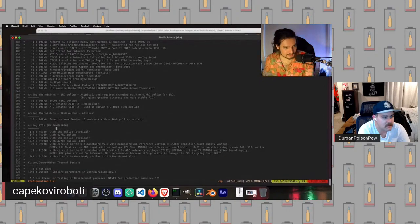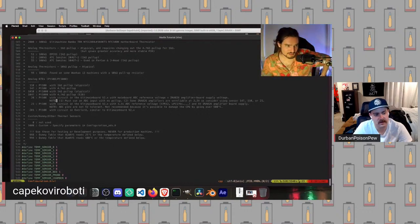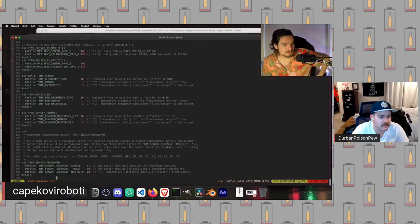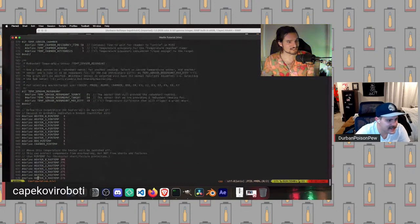Another one to remember, because I think a lot more people are using them nowadays, are these ones down here. These are for the RTDs instead of traditional thermistors, like the PT100 and PT1000. They are pretty desirable in the sense that they support much, much higher temperatures without being crazy expensive or difficult to find. So let's keep going. A lot of these things we could tinker with if we knew what we were doing, but we don't even care what the temp bed hysteresis is. So we're just going to keep scrolling.